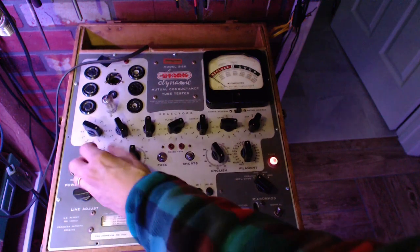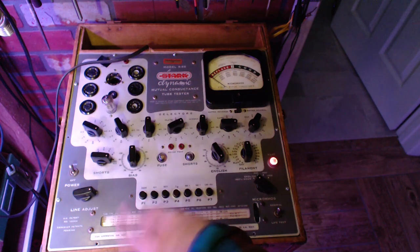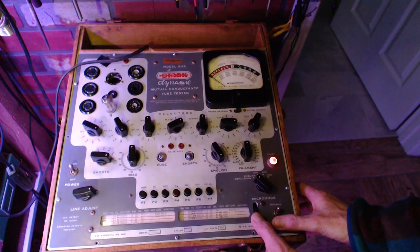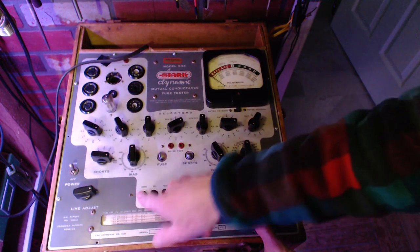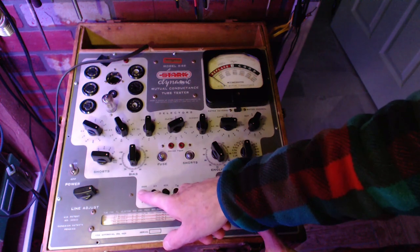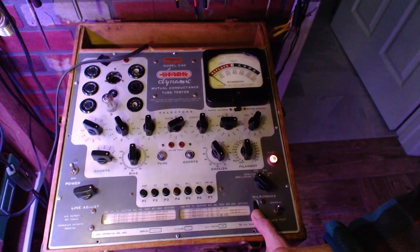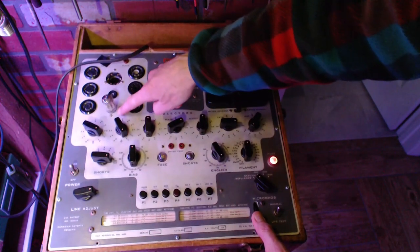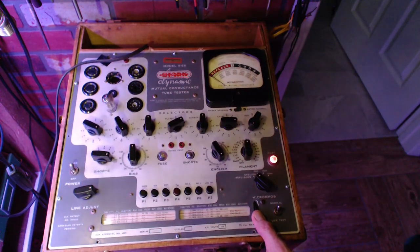This tube appears to be dead. What's the problem? Usually the short light flashes. Maybe not. Okay, we're ready on diode number 2. Oh my gosh. Nothing happened. Well, that might explain why some of this radio is not working. I think this is the detector diodes in here, and there could be 1 for AM and 2 for FM, and maybe this FM one is shot.